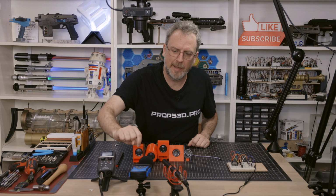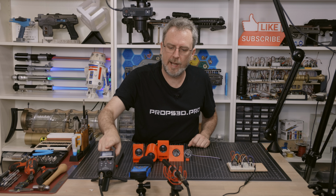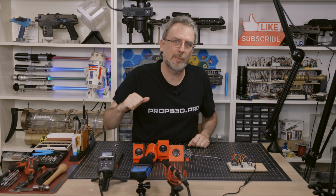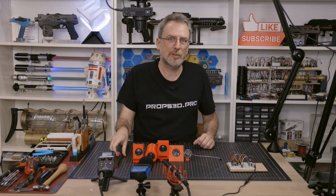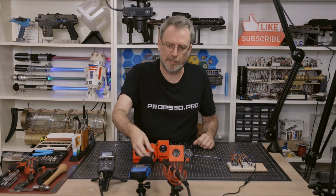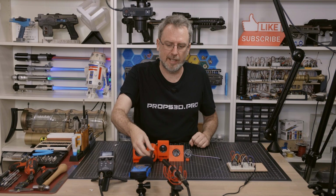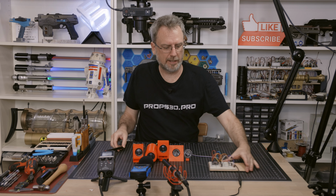We have a dB meter, which we are going to set to max, which will then record the loudest sound it hears. And then we have a Zoom H5, which is manually attenuated. This way it won't adjust the volume depending on how loud things are, so you get kind of an honest impression of the sound. And the most important thing is the stick, which I am going to put from the end of the dB meter, which is going to give us an accurate measurement because everything will be the same distance. So let's get our little MP3 player.